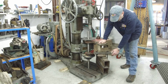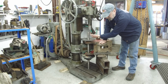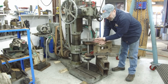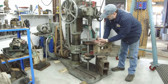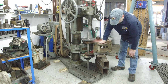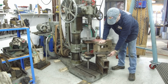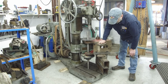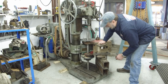We're real close right now, and I pivoted around this direction here. We're going to have an offset here, and it's better to have an offset when you're running universal joints. If you put them straight in line, sometimes you get clatter with them running too close in line. So we offset it a little bit, and that'll be fine. They'll be able to run that way, and we're also able to use these extra long all threads that were sent in to us. So it's the first time we're able to clamp down something with a long reach all thread that we have in-house here.